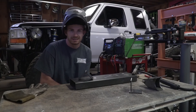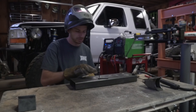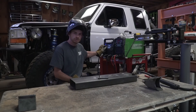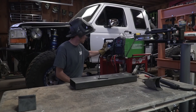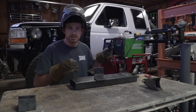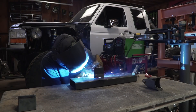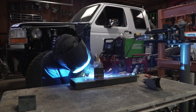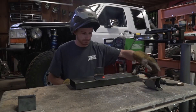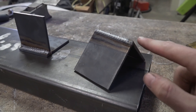I'm going to do the T-joint and bump the welder down a little bit because there's quite a bit of change in the way the fit-up is. I'll set volts to about 18.5 and drop the wire feed speed down to 275. We'll go ahead and burn this together right now and I'll show you the differences between the two.